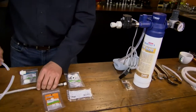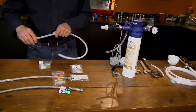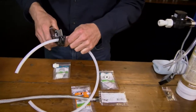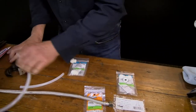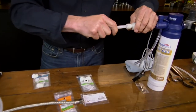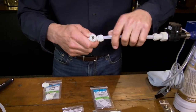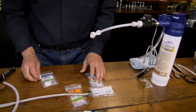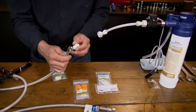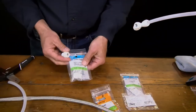Then we're going to go from plastic to a T-fitting. This is also good if you need to do long runs — using plastic works perfectly for that. Now if you're going to go to your machine, normally you'll have a 3/8 BSP there, and we'll use this 3/8 fitting here for that.